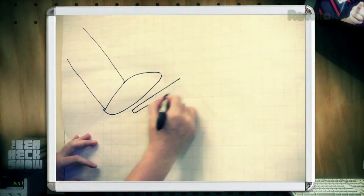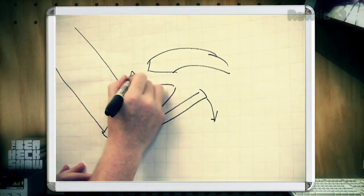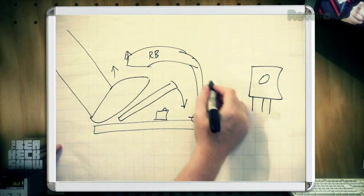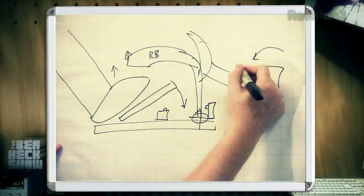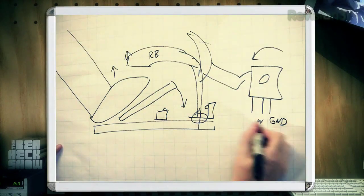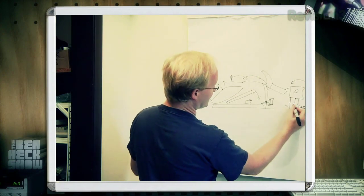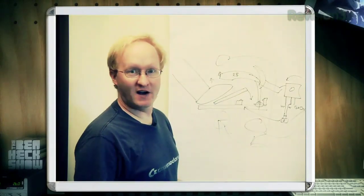Now we've got most of the internal circuitry for the single-handed controller done. The next thing to do is think about the foot pedal. We'll start with the left foot — it's going to have two functions: right trigger, and a thing up here which you push your foot up to click for right bumper. The right analog trigger is analog, and in the 360 you've got a potentiometer. When you push the trigger, the potentiometer rotates — you've got the wiper and the two poles, one goes to ground and one goes to VCC. To simulate the trigger being pushed, we just short out those two things, basically making it all the way over, and attach those to a switch.